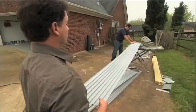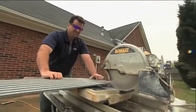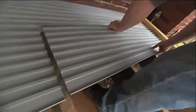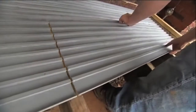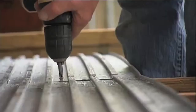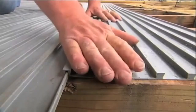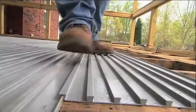It's recommended that you use a wet saw to prevent any of the fiberglass particles from getting into the air. After the TI ProBoard has been cut, place it onto the deck, making sure to get the first board square. Secure the boards to the joist with the TI fasteners. Repeat the process using the interlocking clip on the end of the boards — in this way, each board will lock onto the previous one.